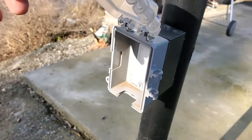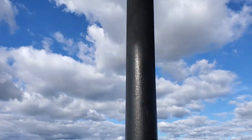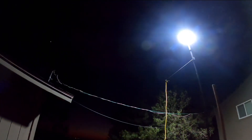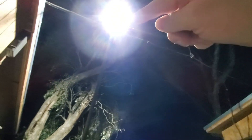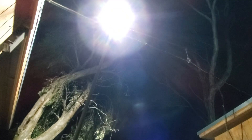Here's the box mounted on the pole with the switch inside to the light. This is an example of a light that we did a long time ago — this light and another light around the corner all run on the same circuit. We have the outrigger here that suspends the wires, but we also have power coming at the end of that outrigger and going up to the light, then it runs to the next light further down the circuit. That way they all draw power off the same source and get controlled off the same switch.